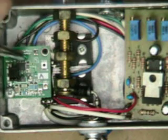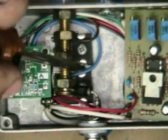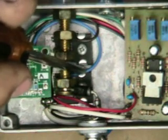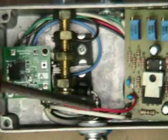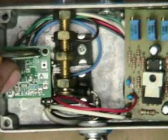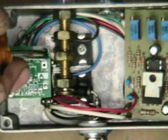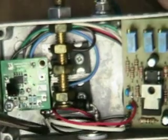What I'm going to do now — this is just bolted down on my standoffs. All the wires come out this way. My two gate wires have to be equal length, so I determined what I needed, stretched them out equally, and cut them off equally going to my gates. Underneath this is a jumper for my R12 — it's just a larger piece of wire that I've soldered on. My R12 sits right here.